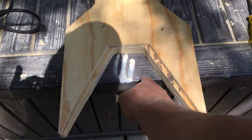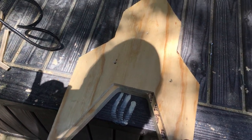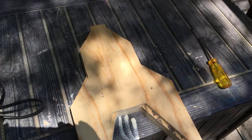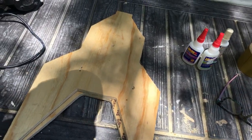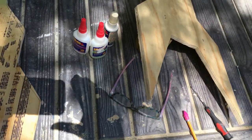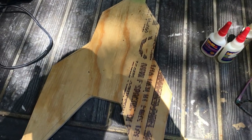I'll figure out the spacing and everything. Then the next step would be to put a round edge — on the top I'm just going to sandpaper the edge and round it real good. On the back, I might do the Dremel tool round bit. I'm ready to glue the top pieces together. I traced out where not to put the glue, so I'll lay out a bead of glue on these top two pieces.